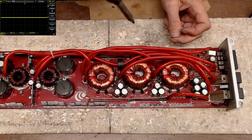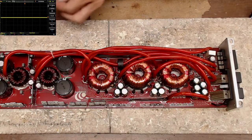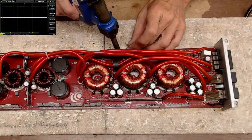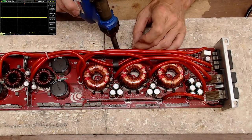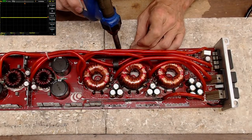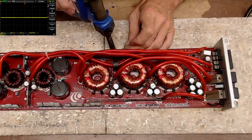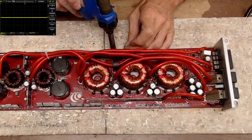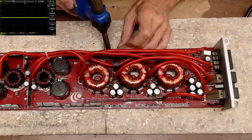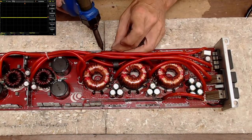Whew. Yeah, this one failed drastically. Let's see here. Anything going on? Nope. All right. I highly doubt that this is going to start up because I do believe I have some bad transistors on the drive here, or what people call drive buffers. But it really is just your drive transistors.